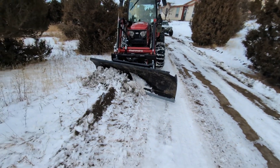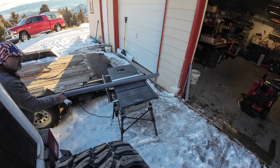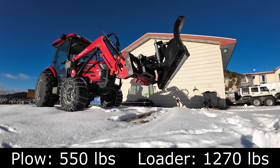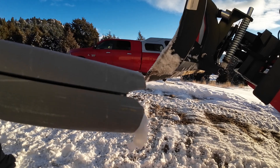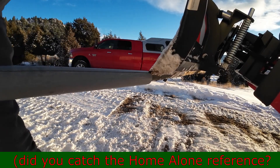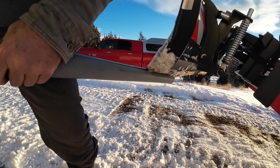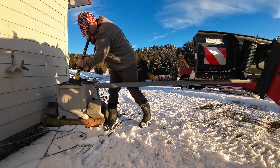But what I didn't understand at that time were three things. A, the cold weather definitely affects brittleness. Two, the weight of my snowplow and loader is a lot of constant pressure on a thin piece of schedule 40 PVC. And B, my plow blade is one half inch wide. So yes, a single cut with a narrow saw blade is going to make a nice tight fit when I pound it on, but will also significantly widen the circumference of the pipe and weaken it.